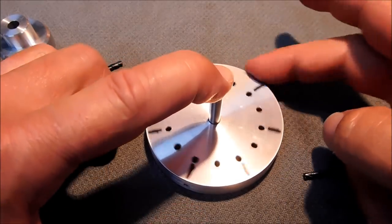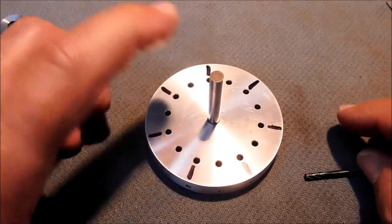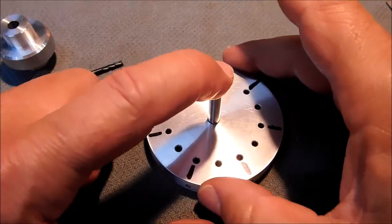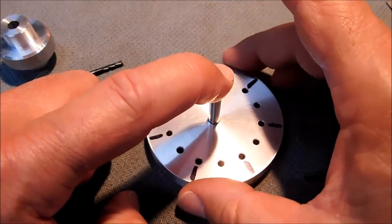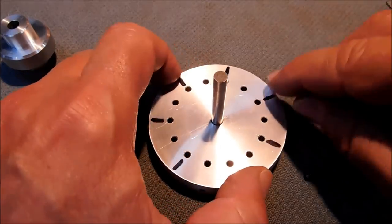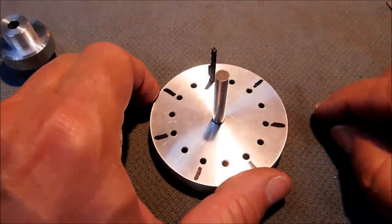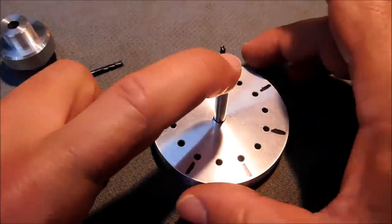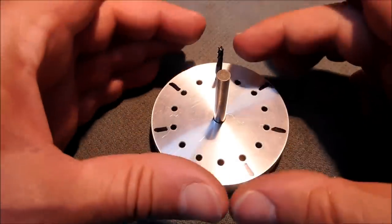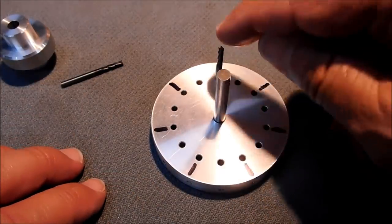It's not going anywhere. It is trapped. What you need to do now is control rotation. You can control rotation with a hole, yes, but it has to be an incredibly precision hole in order for it to line up with all of these. Or that hole can be a slot. Because when this pin comes around, it's going to find that slot, boom, it's going to drop in. It's not going to rotate, okay? The rotation is now locked. The concentricity is now locked with a hole and a slot. It does not have to be two holes.